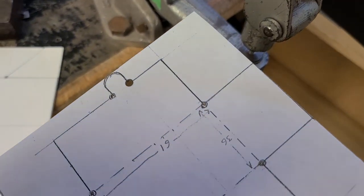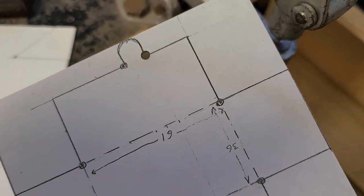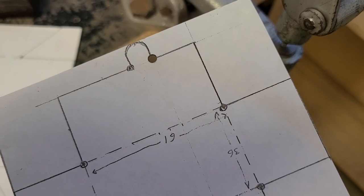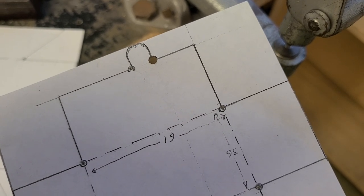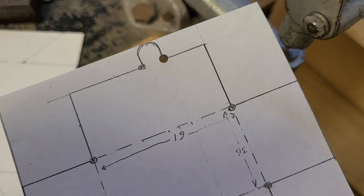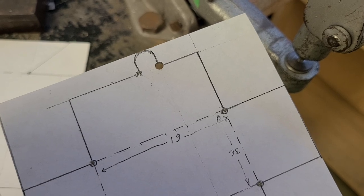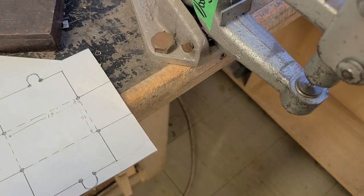So that when I punch out the inside corners right there, that's going to create a nice little curved section for when I cut into the corners, and it's going to allow me to have a little bit of radius on the bends right there. You'll see how that works out when we start doing our other cuts and our folds. So, time to punch.